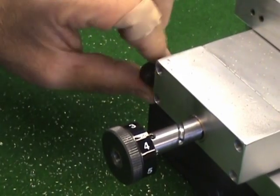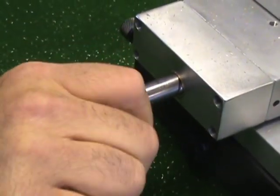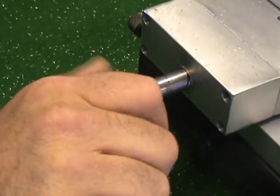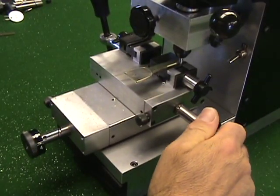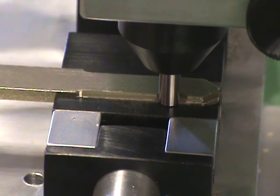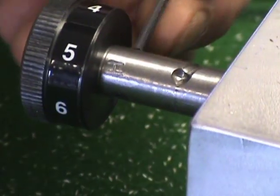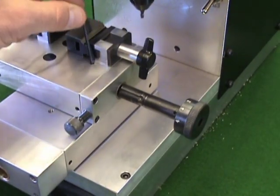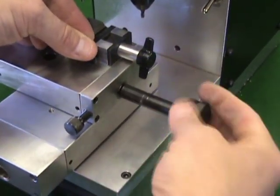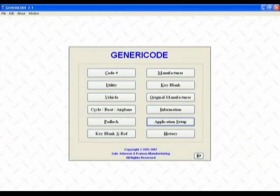To adjust the spacing, engage the space rod by tightening the thumb screw. Rotate the space rod until the detent engages the rod and turn the rod to the number 4 space position. Turn the depth rod to the deepest position, in this case a number 6. The goal is to center the guide in the cut by adjusting the cam as done with the depth rod. Turn the screwdriver until the guide is centered in the cut, then tighten both Allen screws on the rod. The depth and space rods are designed so that you can remove them and reinstall them without the need to adjust them each time. If you have dial calipers, the adjustment can also be made by reviewing the depths and spaces shown in Genericode ME and determining if your machine is cutting properly.